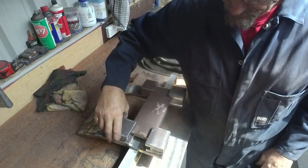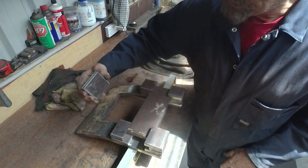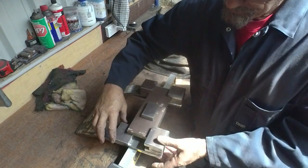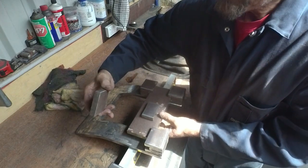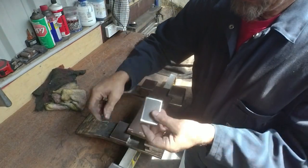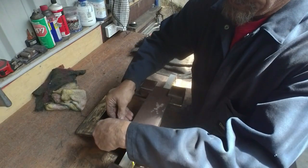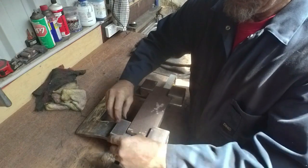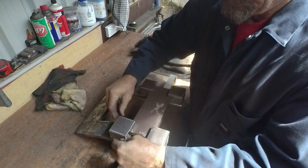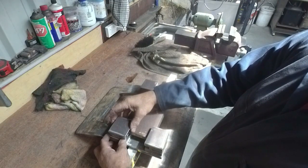Just going to point out the process I'm going through here. This is one that hasn't been welded together yet so I thought I'd show it bit by bit. So that's my bottom spacer — that is the same 16mm plate. Then I have one that's cut 15mm narrower than that to put in as a spacer. That goes in as a spacer like so. And then this is another one that's cut the same as the bottom one, which overlaps like so and sits there. So I have made three of these already and this is the one I'm about to weld up now.